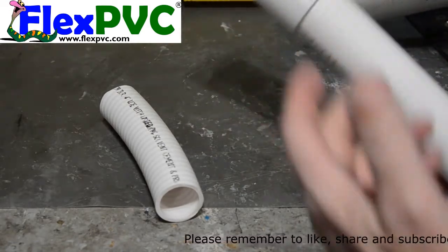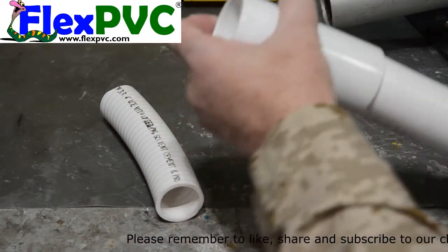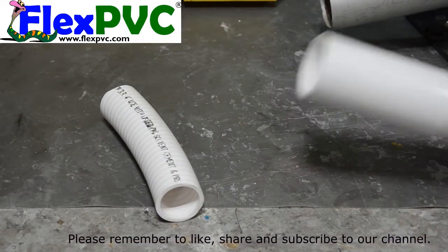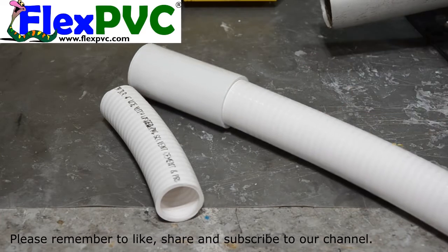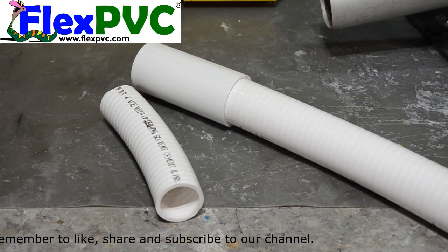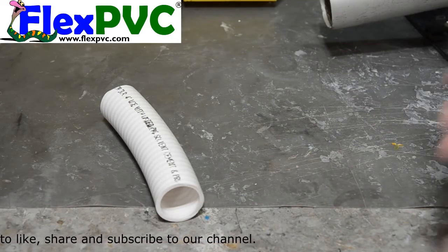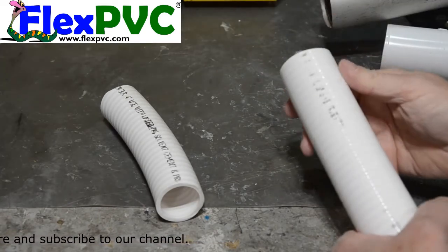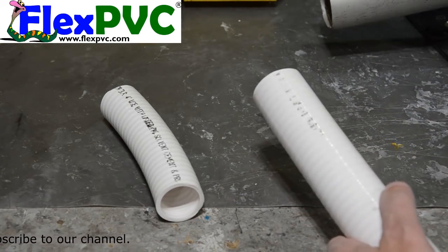I'm just checking to see how warm it is. If you wait a little bit until it's cool, then you can take the coupling off and that'll reform the end. Don't worry if it's not perfect — you might have to redo it a couple times. Just as long as you don't overheat the pipe you'll be fine. Turn off the heat gun and get it out of the way. Once you pull the coupling off and it's room temperature, do not apply glue or primer while it's hot — do not do it. It will evaporate the primer and dry the glue instantly. So once it's cool, apply your primer and glue, then shove it into your socket. That's all you should have to do.